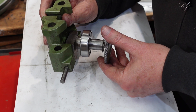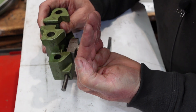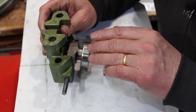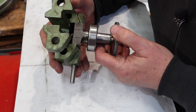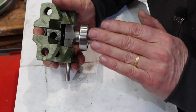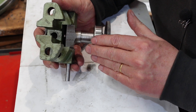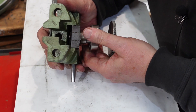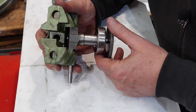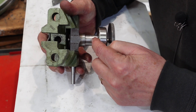This is a wheel tilt device for a bandsaw. What it does is change the axis of the bandsaw so that the surface the blade runs on is tilting, and that way you can get the bandsaw blade tracking properly. There's a screw that goes right through and sits on the casting — by turning that back and forth you're tipping it. There are a couple of bearings that run on here that the wheel with the bandsaw blade runs on, and that's the problem. The bearings are a 20mm bore and this was made for 19mm — one of the issues with converting from imperial to metric is you sometimes can't get the size you want.